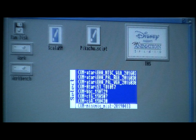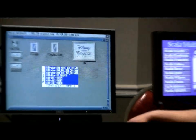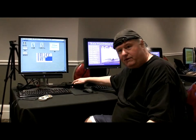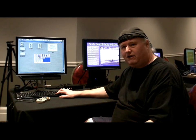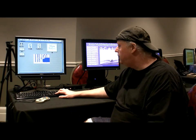The MiST board does have a limitation. It has an 18-bit decoder, not a 24-bit color decoder. So it'll scale the 24-bit color down to 18-bit. So far, it's been pretty accurate at the scaling. I don't really notice the difference. It seems pretty accurate to me in the conversion. I've played HAM-8 animations and those things. They look fine. Look like the regular HAM-8 mode.